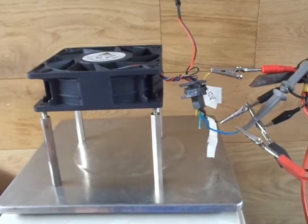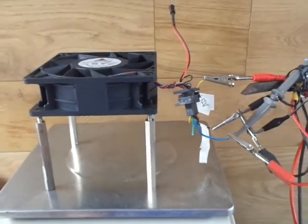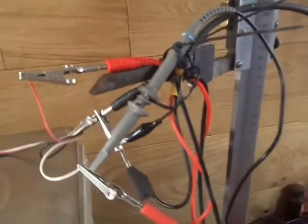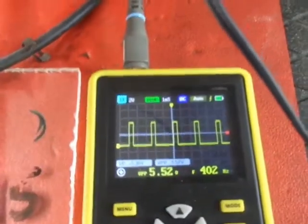I think you should be able to control this using a standard radio control system — I'm going to experiment with that in a minute. What I've done here is I've wired in a servo to the existing setup, and the only thing I've changed is the supply voltage which is now 5 volts. There's my pulse width modulation.